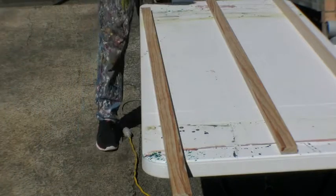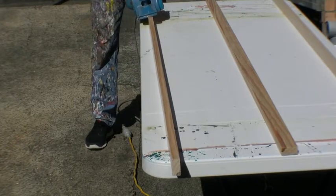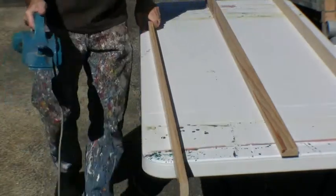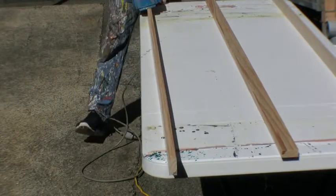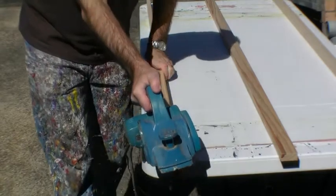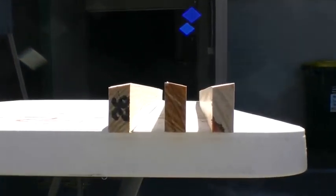To start with, we have our nice straight timber. Get your timber yard or lumber yard to get you the straightest timber you can find. Then we bevel off one edge of that timber frame — as you can see here, I'm just running the plane along on an angle. You can use an electric plane or a hand plane, whatever you have, or ask your timber yard to do it for you. You'll see we're going to have your timber with a beveled edge on it like you can see here.